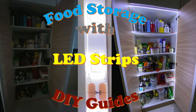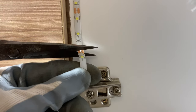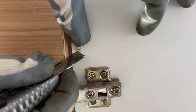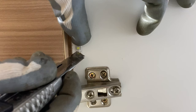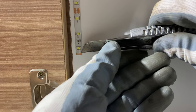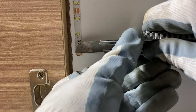To start off with, you must stick your LED strip onto your cabinet and then cut along the line — it's indicated on your LED strip. My one here is a LED strip that comes with a weather shield, so I'm going to remove the weather shield to expose the copper terminal. This is where the wire will connect later.